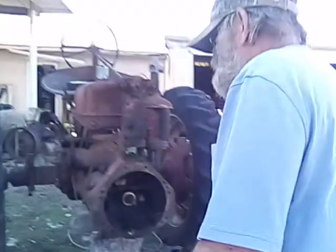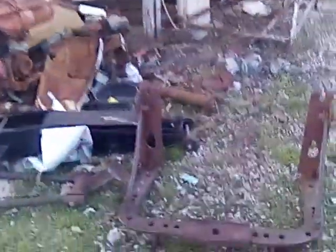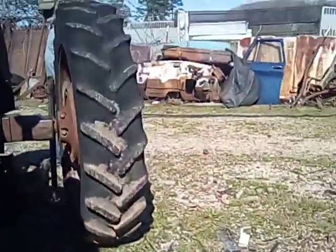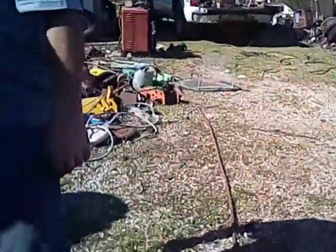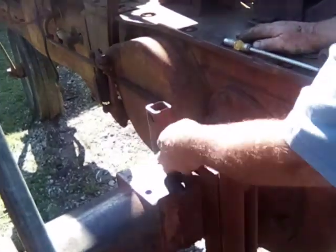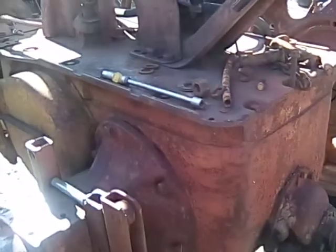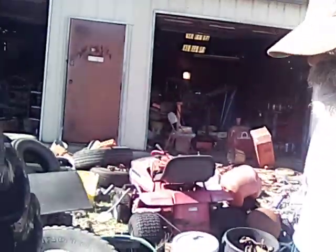I went ahead and spread these out. Then moved these brackets over and spread them out on this axle. This little 3-point hitch I got, homemade hitch, it's got 4 holes. You can have them in, or you can have them out. And I would rather have them further spread out. So I just moved them out. The reason I do that is because if you ever want to get into the brake drums, you always got to take this off before you can get that brake cover off to work on your brake linings or anything. If you wanted to work on your brakes, put it on out there. It's all the same. But it's just a simple homemade 3-point hitch.